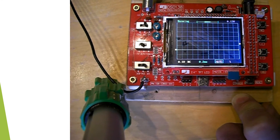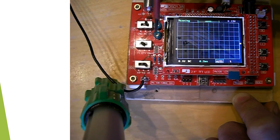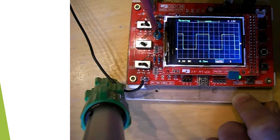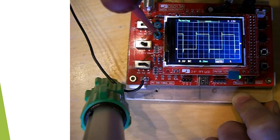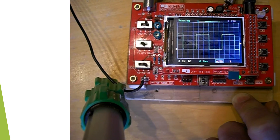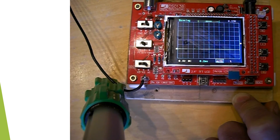What we have here as well is a couple of pots for changing the shape of the waveform. What you can do with these pots is adjust them so your waveform is square — that is to remove the capacitance when using the oscilloscope test probe. Obviously many people have their own test probe, so they all have different capacitance. Both pots will give you some adjustment.